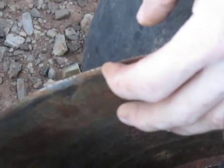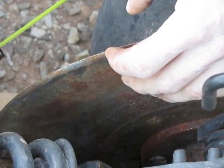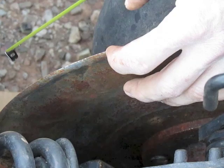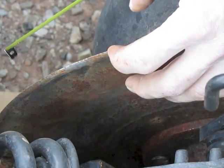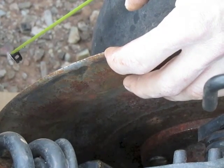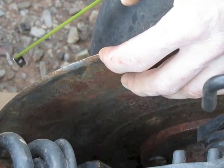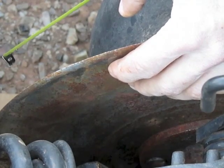If you are meticulous about replacing your blades and keeping them very sharp, it won't put near as much wear on your seed boots, and that's a more expensive item to replace. So keep your blades in good condition — replace them yearly or whatever you need to do to always have sharp blades. You'll cut the residue a lot better, you'll maintain depth in the soil better, you'll burn less diesel, and you won't wear out your boots nearly as quickly.